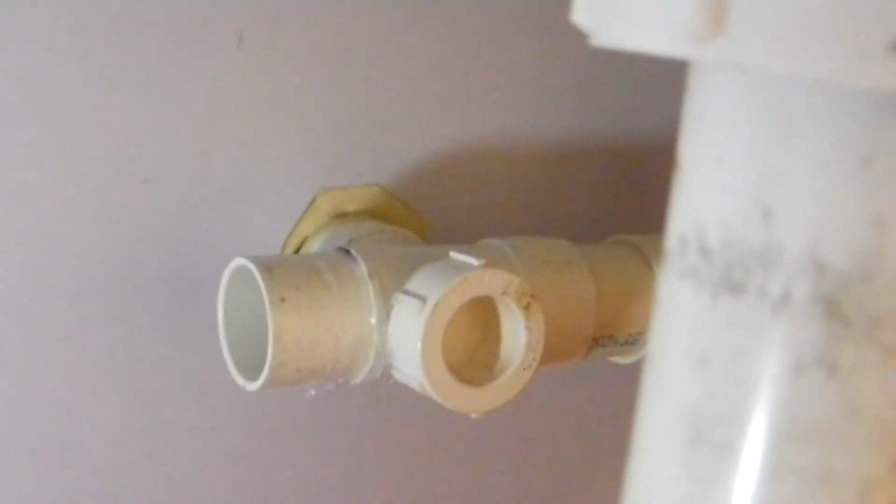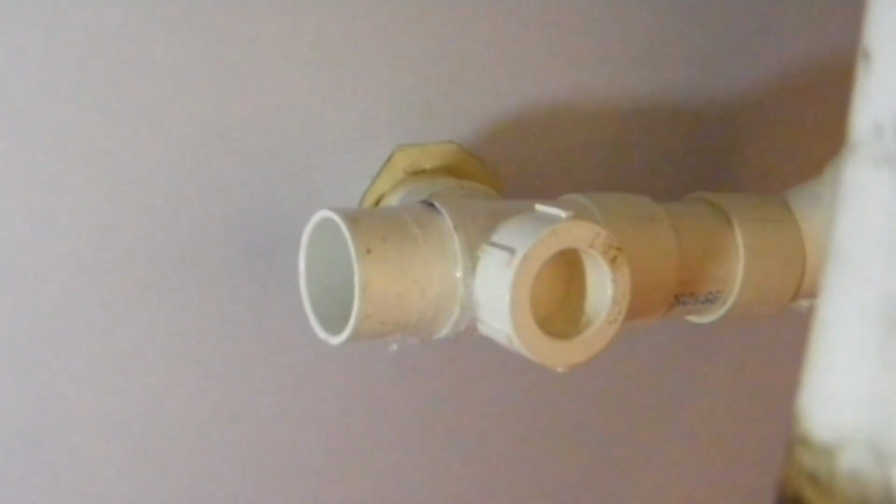So what's going to be the critical joint here will most likely be fitting the T onto the stub, because that's a collar. So that means a little tiny piece of this stuff is going to be projecting out of that, and the T joint is going to go onto that. This piece here just gets screwed on. So the only thing that's really hypercritical to glue is the joint into the T; all that stuff before it can be done outside, underneath here, so it's just ready to pop on. And then you set that sucker in there. So I would say that that's the critical joint.